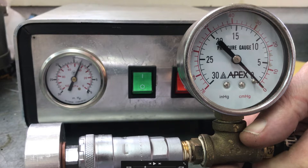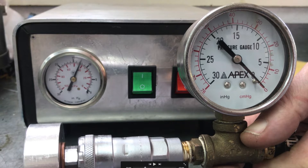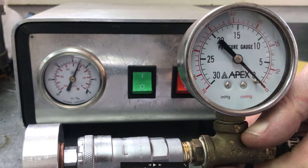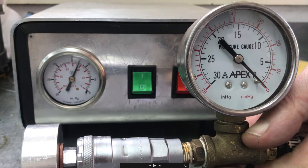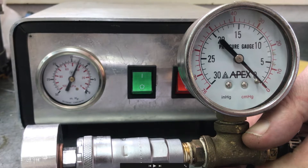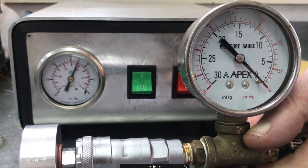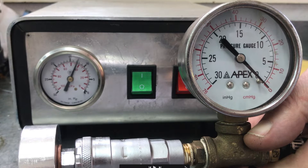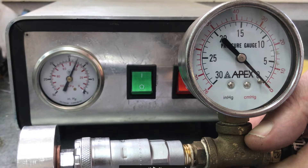The vacuum hose is open and the gauge is reading zero, which is correct, but the one fitted into the box is almost halfway on the gauge — so that gauge is faulty. It's new and supposed to be made in Spain, but it's faulty. So I'm just going to work with the one I've left on the hose.